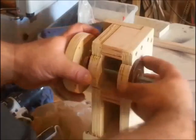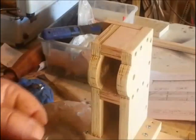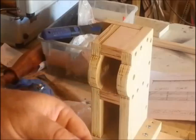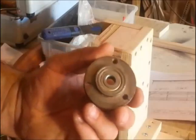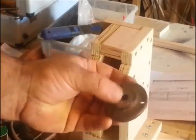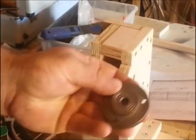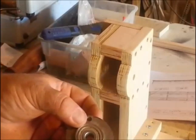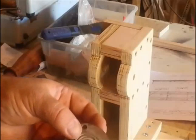For the headstock bearings I'm using flanged bearings with roughly a 3/8-inch interior diameter. I pulled these out of an old Central Pneumatic six-inch disc sander — the pistol style. You can get these online, and the local hardware store here carries them. But if you can't find flanged bearings, in the next video in a couple of days I'll show you how you can make your own.